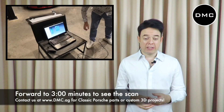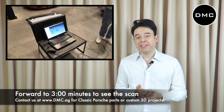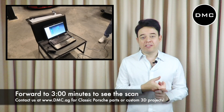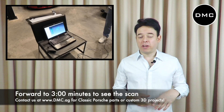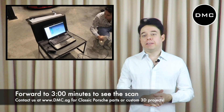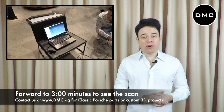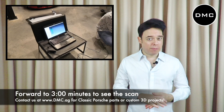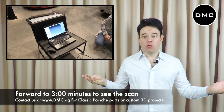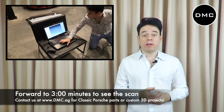That mold would then be able to produce the newly shaped bumper. Obviously there are a couple of advantages but also disadvantages with that method. First of all is accuracy — whenever you work with an existing part, the new part is based on that part, but when you work with clay there's always a certain error margin: we're talking about 1mm, 2mm, up to who knows what, depending on the final production method used on that mold.